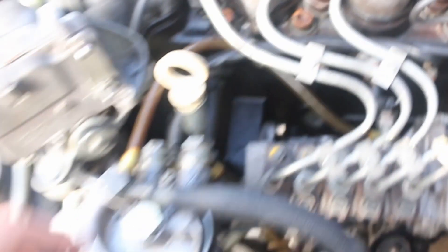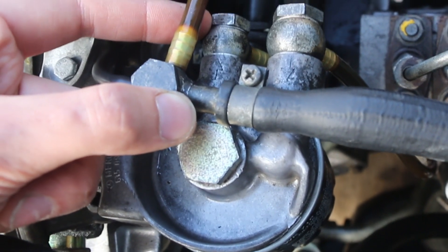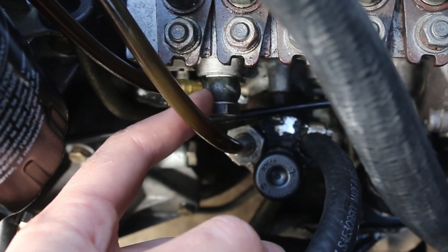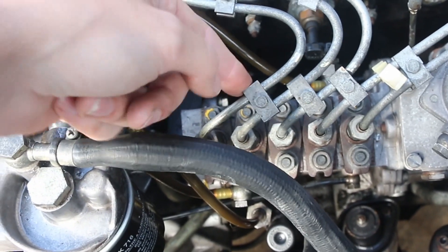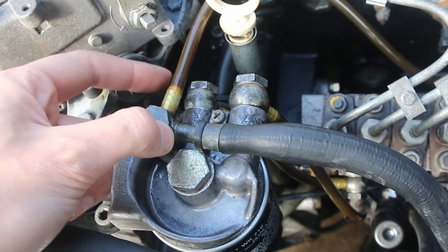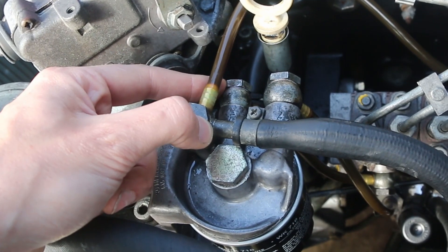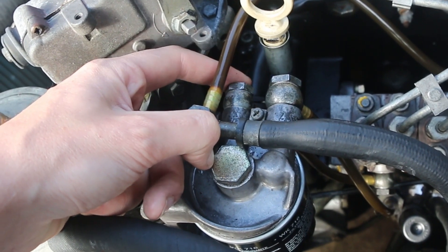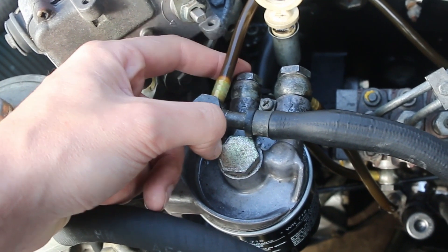To test both of these things, we're going to tap into this port — the outlet port of the secondary filter, the front-most port — which runs down to the injector pump right here. So this is the inlet of the IP and the outlet of the secondary filter. That's going to test our internal pressure on the low pressure side of the injector pump. What we need for that is a tapped banjo bolt. You can buy them online easily — there will be a link in the description. They're M12 by 1.5 thread, or you can center punch and drill a hole in one, tap it to eighth-inch NPT, and plug in a pressure gauge. Anything that reads zero to 30 psi will work perfect.